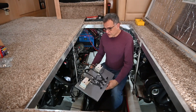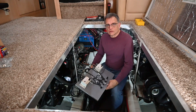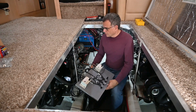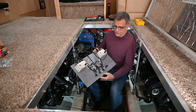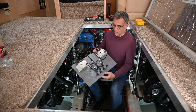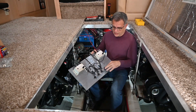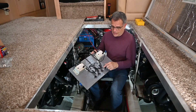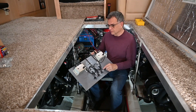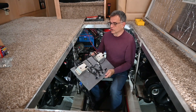Hello and welcome back. Today we're going to take a look at installing the Fox Marine MEFI-3 engine gateways for my 454s on my Carver 406. I mounted them to a board to allow for a nicer installation, and if I ever have to work on it, I can pull the whole thing out in one piece. I've also put my backbone down here. I'm going to replace this tomorrow with a four-in-one manifold to allow one more port for expansion, but for today I've got three T's hooked up. It will serve the same purpose and we'll come out with the same result.